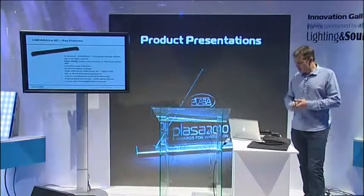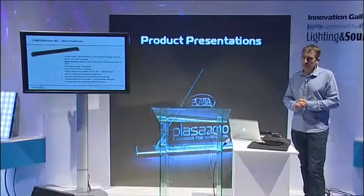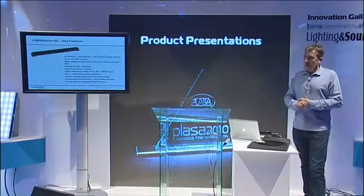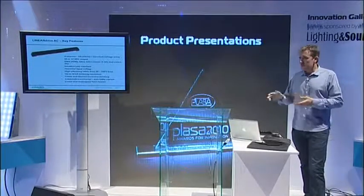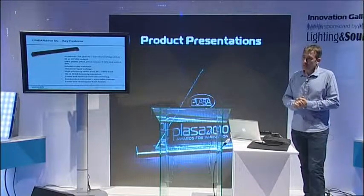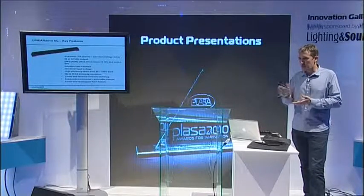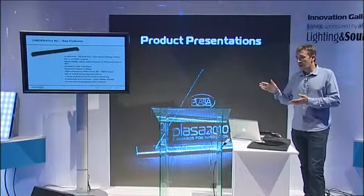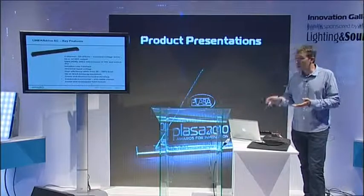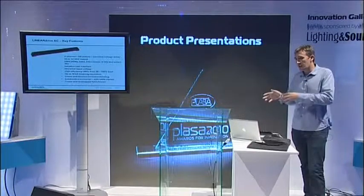It depends, actually. The cost of deploying different control inputs isn't a huge cost. So it's not more cost effective to just have one unit dedicated to the in and the out that you need? If you were producing, say, tens of thousands of units that were always going to be DMX, then that's probably more cost effective. But what we find now is some installations are definitely DMX, and some are not. Now you've got DALI color coming onto the scene. Traditional buildings like DALI, the entertainment industry likes DMX.